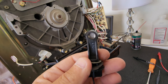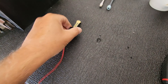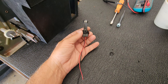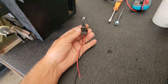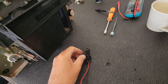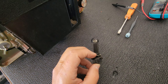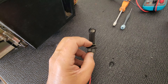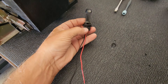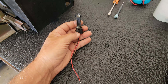This one looks relatively like new. I took it out and checked it with a meter, and it does drop in resistance value when you cover up the light sensitivity. And then when you uncover it, the sensitivity jumps in different directions. So I did take this one out and I'm going to swap it out and put it in my unit. The one I have in there now looks like the little sensing lines are deteriorating — the material is starting to flake away and it just isn't working right. I've got a funny feeling we've got a bad sensor in there, but this one here I think works. So we're going to swap that out.